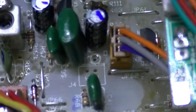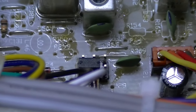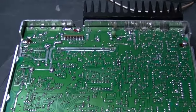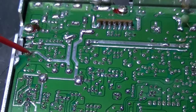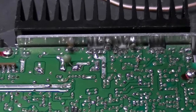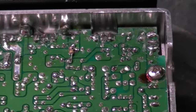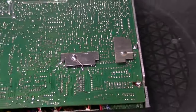There's your channel conversion — this one hasn't been converted yet. It's been a while since I've done a video, getting a little rusty. On the backside of the board, you can see the traces to the finals are a lot heavier, as are the incoming power and ground traces. There's your AM regulator, and here are your finals where they're soldered onto the board. The solder looks decent — not pristine, but not bad compared to other radios I've seen.